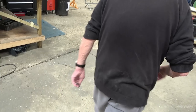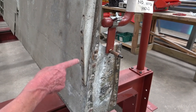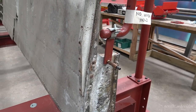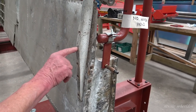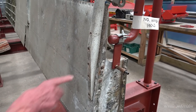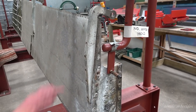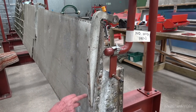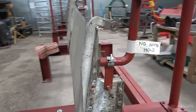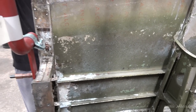You can see they go through the skin — the bolts inside there were all corroded. Have they corroded and broken off? Yeah, the corrosion between the bolt, which is steel, and this, which is aluminium. We'll try and drill through the bolt to get this off. If not, we might have to cut the skins — but I really don't want to do that because then we lose the skin positions and everything. That's another little job.